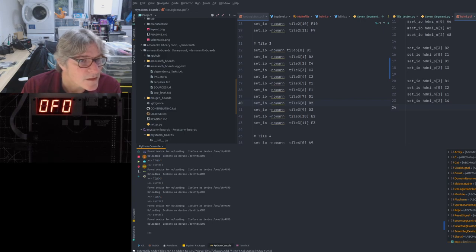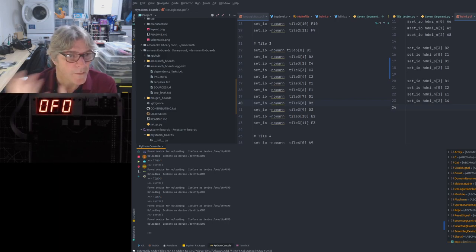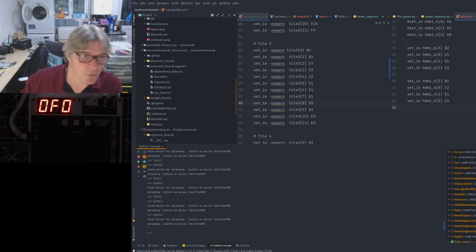iPost says, for me, it would be an I2S chip. What do you mean by I2S chip? You can do I2S in the FPGA. You don't need a chip for that. You only really need a chip if you want to do the codec and if you want the combination, like I2S, analog in and out, and a monitor, audio monitor.